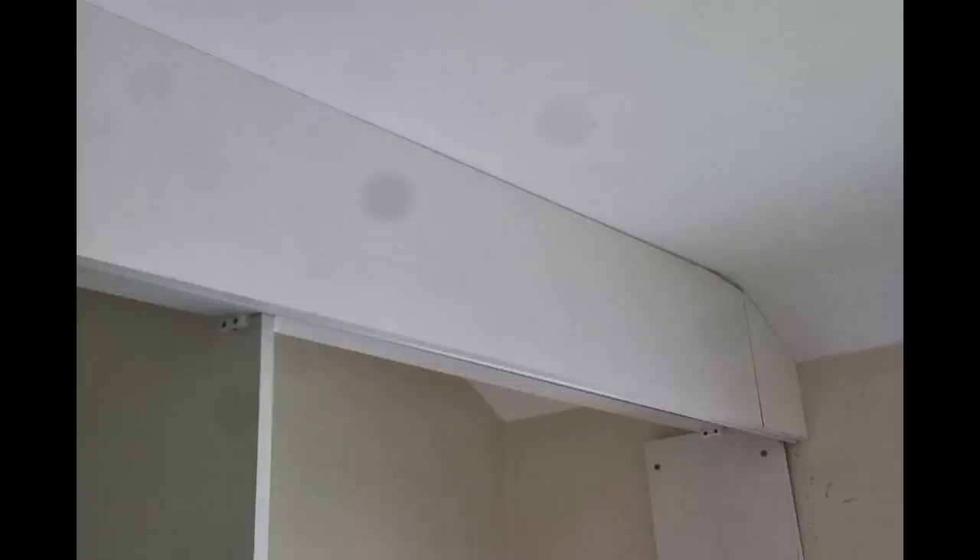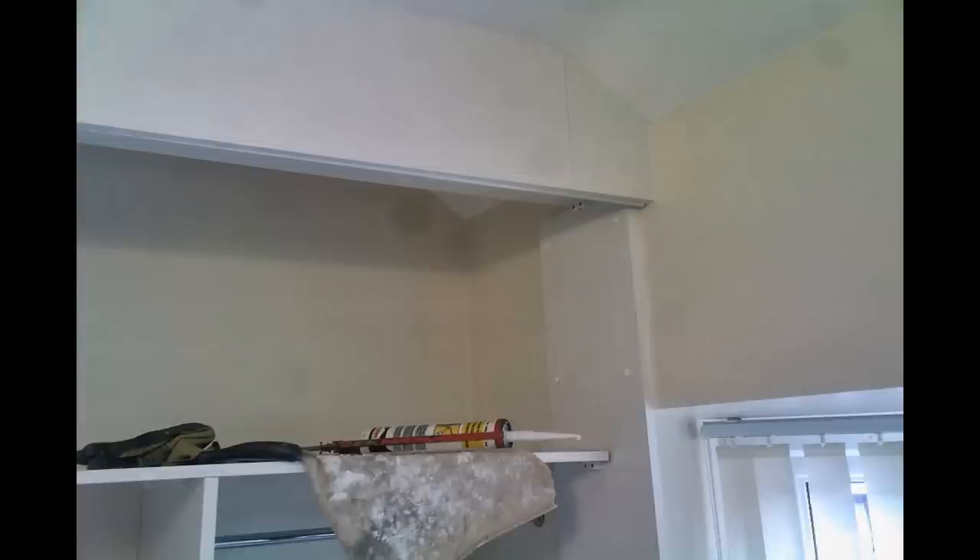The top track of the sliding doors was cut to fit the side panel and walls very neatly. The top track was screwed up along its length and by coincidence was flush with the nine inch piece of Conti board we had used for the fascia board, which only had to be trimmed slightly for the curve of the ceiling at one end. Decorator's filler was used for a good finish.